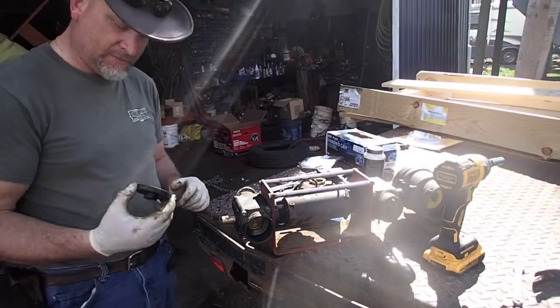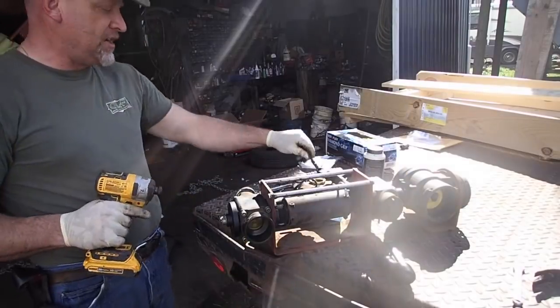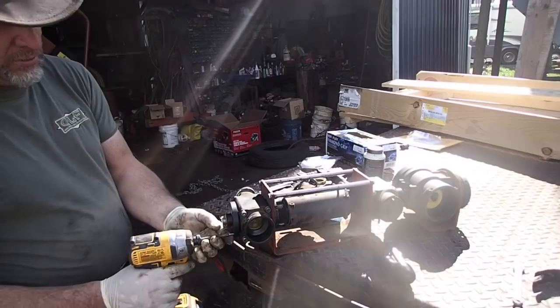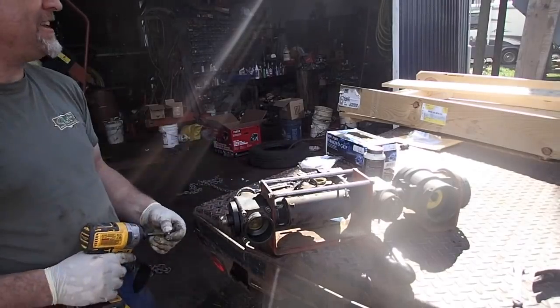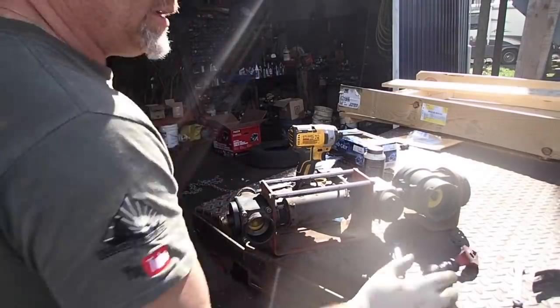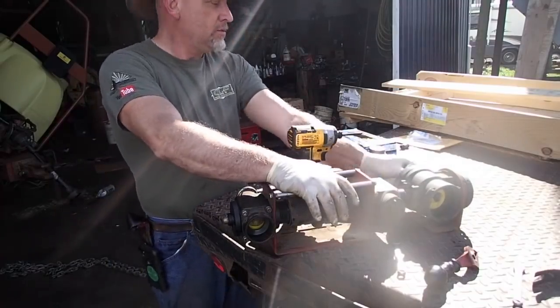So I just can't believe I did it last night. Yesterday was just frustration number one. The Hardy Commander is down. I cannot get it to work. I had to order new wiring harnesses. I have a broken wire in a wiring harness someplace. I'm not sure where. Went all the way to Richland, got a speed sensor because the speed is not registering right.